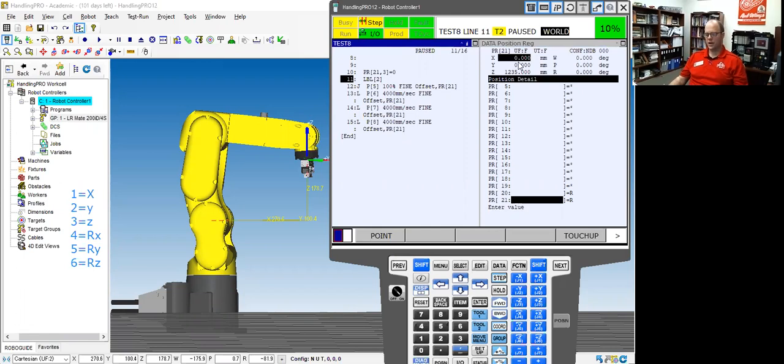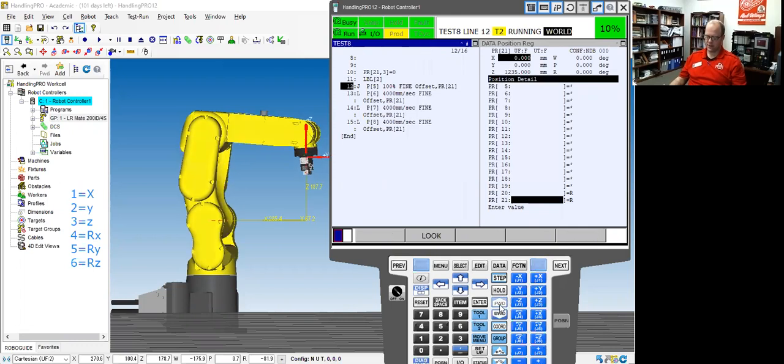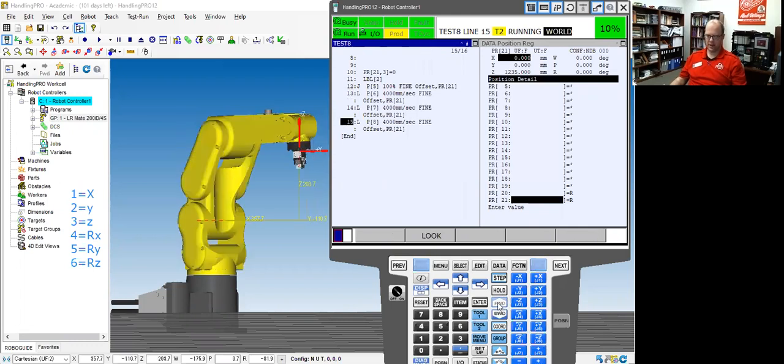And by the way, if you want to clear this out, you can either do it with commands that look like this, or you have a known position register and set the position register equal to 0, which I could show you in a second. But so right now, if I run this job, before you saw it clearly went down. Now if I run this job, because it's outside the jump label, I'm going to turn off step. You can see it's in the same place, the same location. Okay.